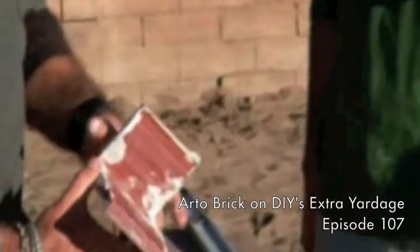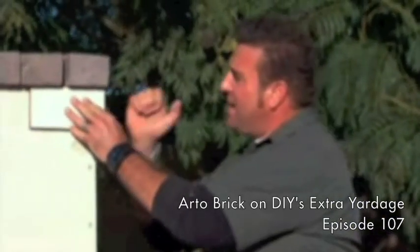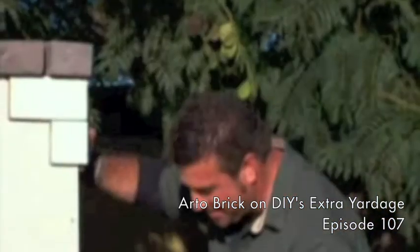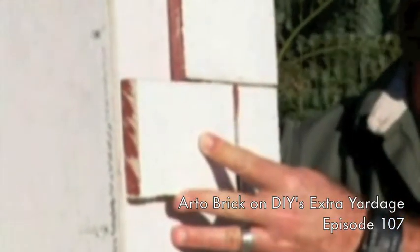As you can see, just regular red terracotta. So you go ahead and notch it, right, with the trowel, and put them on. Now these, suction holds them until the thin set will dry. So let's see if we can get that one to hold. And then the next piece will go like that. And again, we're gonna butt them together. We're gonna have no grout in the joint. Okay. Very old European.